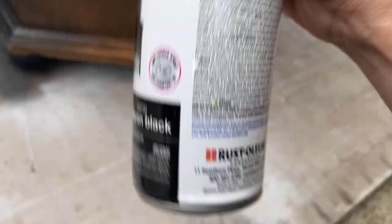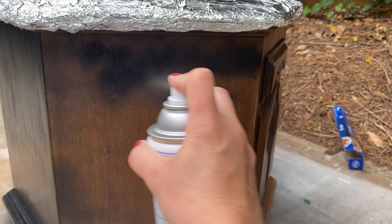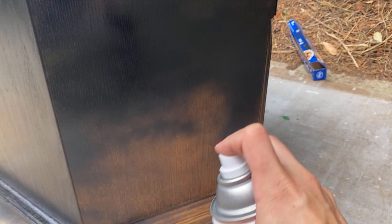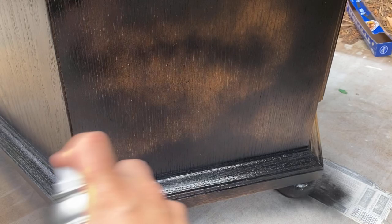When you are spray painting, you want to do short little strokes — little blasts of paint. I'm pushing on and then releasing, on and then releasing. A lot of beginners will push down the button and just go back and forth with a continuous spray, but that is actually improper for spray painting and will give you a streaky finish. I'm definitely going on, off, on, off with the button, and that's giving me a nice finish.